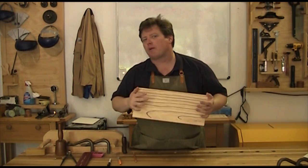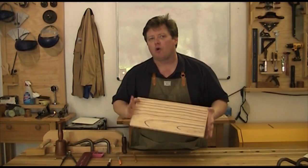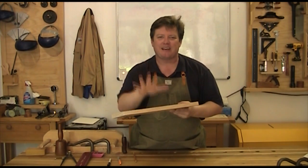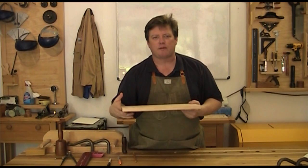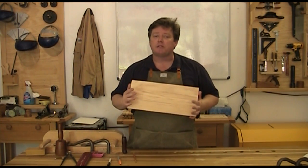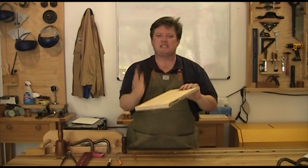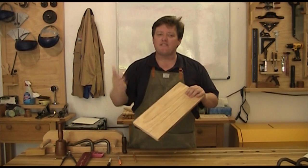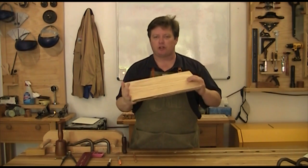So in effect, when you're buying a 1x8 board, you are buying the board from the tree and paying for the services to make it nice enough for us to use straight from the get-go. If you go straight to the lumber yard, you can buy 4/4 material that hasn't been all dressed up, but it still has shrunk a little bit. But you can save a little money that way because you'll be doing the dressing yourself.